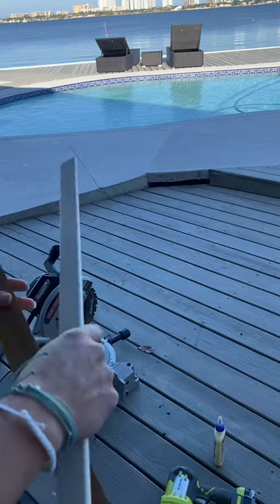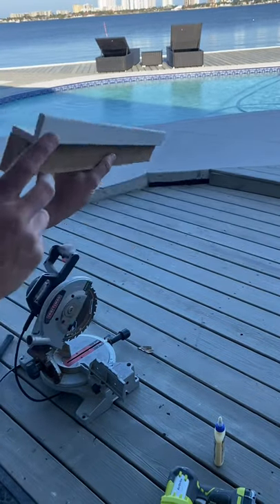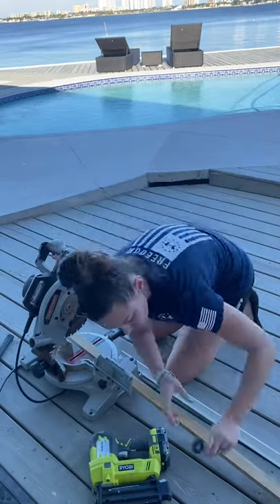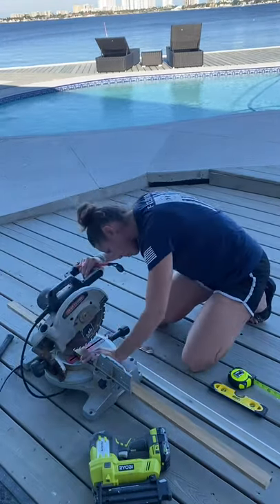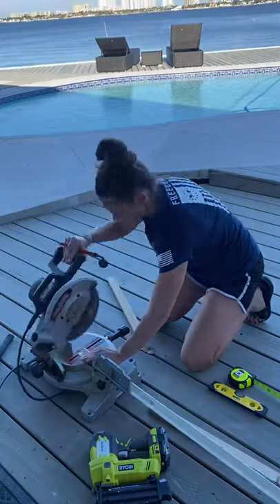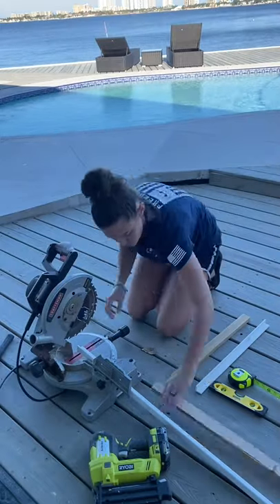Here's what it's going to look like: I have a piece of one by two and then I will be sitting a PVC outside corner molding right on top of it. I'll be attaching it with construction adhesive and also my brad nailer. That outside corner molding can be used as a picture ledge or if you want to lean anything up against it. I'm using my miter saw to cut five pieces of one by two to those measurements I just took on the side of the pantry. I will also be cutting the PVC outside corner molding for the four bottom measurements — I won't need the top measurement because I have something else planned.